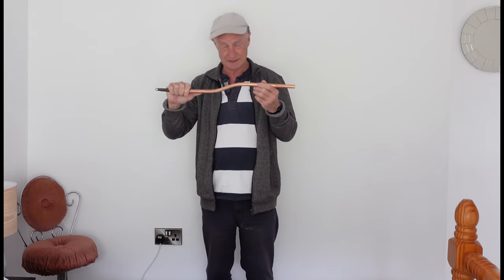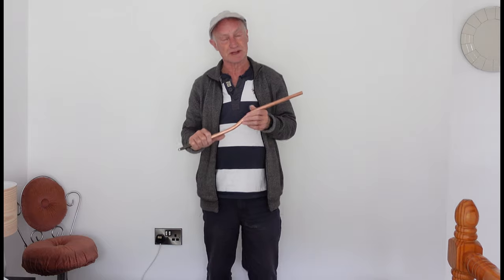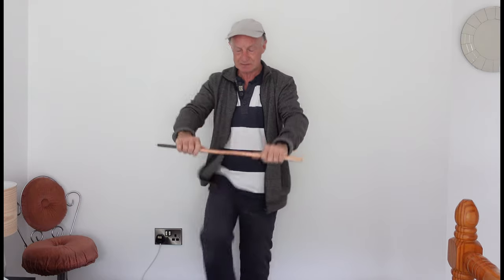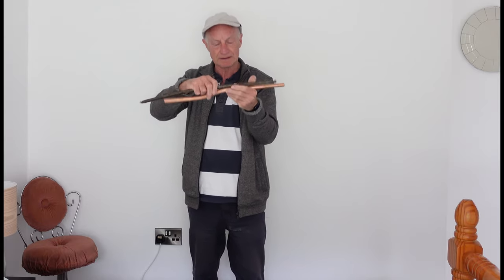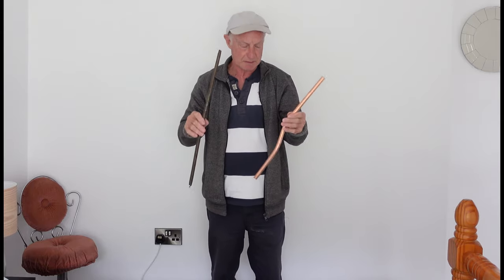That said, it's a handy little tool. If you want to get the spring out easier, it's best to just back the bends off a fraction on your knee and then it'll pull out easy. Otherwise the spring also bites on the bend and you'll be pulling like this and it won't come out. So that's another little restriction.